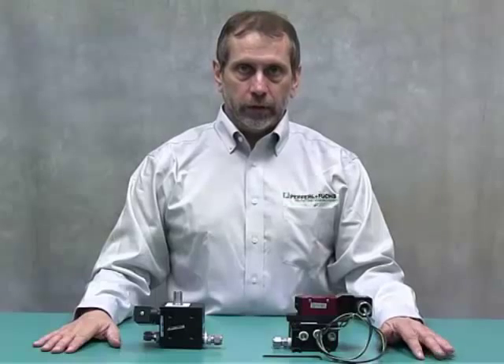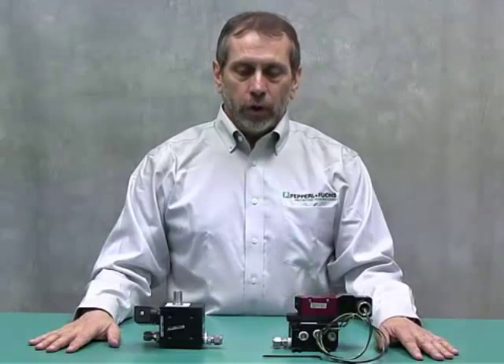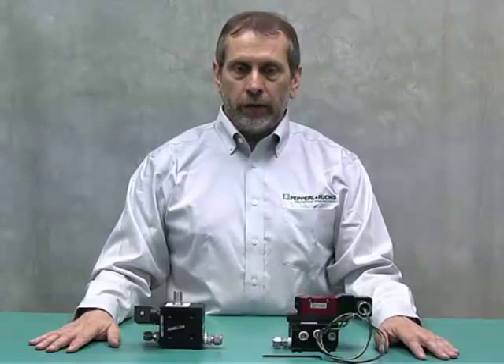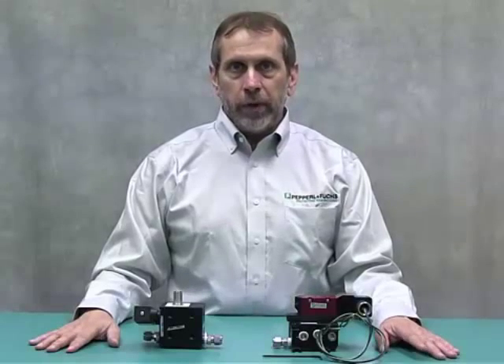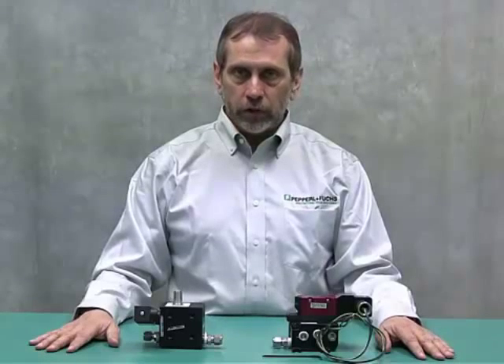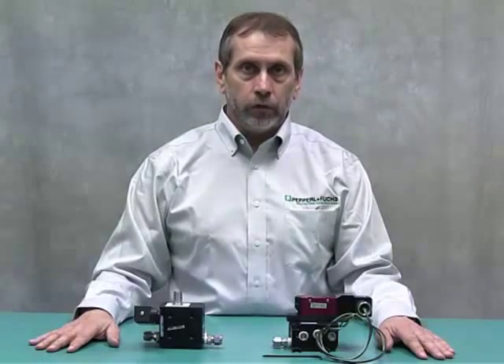The 5500 Series System consists of the control unit and the vent. So now you need to get air inside the enclosure. The way this system works is that the flow rate to determine the purge time is based on the enclosure pressure. We have tested that through each individual vent. If the enclosure pressure is a certain value, then your flow rate will be a certain value. We offer curves in the manual that will indicate pressure versus flow through each vent.